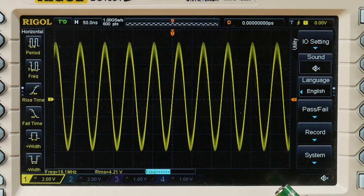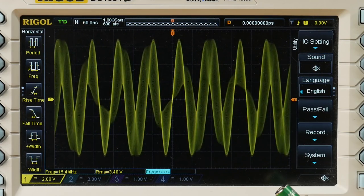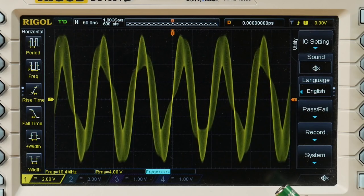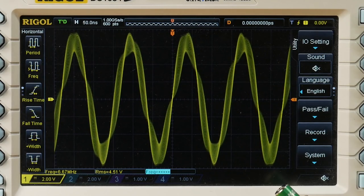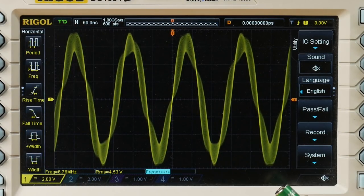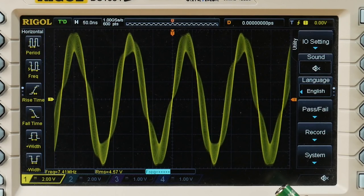But as you can see, we're getting this sine wave here, and this is the maximum frequency that the ADC is capable of capturing. And if we try and boost the input frequency still further, you can see an interesting effect occurs where, if you see past all the aliasing stair step problems, you can see the frequency is now actually descending, and it's going down and down and down until we get the signal generator to its maximum output frequency at 25 megahertz. But you can see we're seeing a frequency quite a lot lower than 25 megahertz. And the reason for that is that we have an aliased version of the input image here. The signal that we're capturing is now being subsampled, which means that we're not seeing the true sine wave fundamental now. We're seeing a version of it which is kind of like a reflection around the Nyquist frequency.